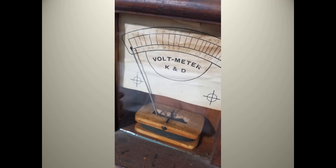The magnet and indicator are balanced so that the position is at zero when no voltage is applied. To act as a voltmeter, the voltage is applied to a positive terminal and into the coil, then exits the coil and into a fixed resistance, then to the minus terminal. When a voltage is applied to the coil, it produces a magnetic field strong enough to overcome the force of gravity and deflects the magnet and indicator in a way that's proportional to the voltage that was applied.